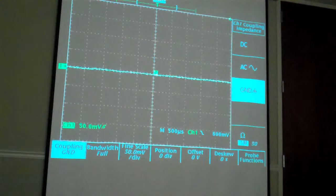Well, there are other types of oscilloscope probes made. You always want to make sure you have a probe that's suitable for your oscilloscope, with an appropriate bandwidth. This particular probe is rated to 500 megahertz, and I know it's a match for this oscilloscope. Typically I guess you want the bandwidth of the oscilloscope to be at least 5 times the highest signal speed you're going to be looking at. Is that what y'all have heard, or does it not necessarily have to be that to get an accurate measurement? Also, I have a set of FET probes for this, which I believe are really more for high frequency.